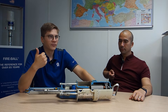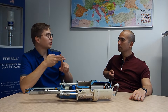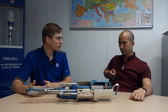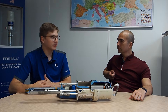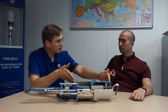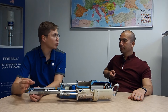It's important to know that within one family of pumps, Graco has fireballs in 5-to-1, 3-to-1, 6-to-1, 10-to-1. For example, the series of 3-to-1, 6-to-1, and 10-to-1 share the same size air motor of 4.25 cubic inches. They all have options of 3-to-1, 6-to-1, 10-to-1, meaning if they have the same air motor, what is different is the lower part. The 3-to-1 has the bigger lower part, 6-to-1 smaller, and 10-to-1 even smaller.